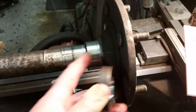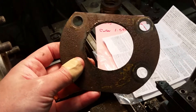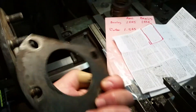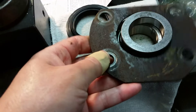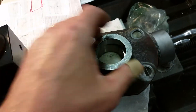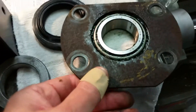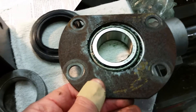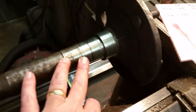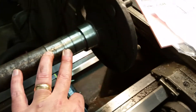The retainer plate is not going to hold much - I've lost an axle shaft more than once and you think that plate is the whole hail Mary, but it's not. I have made these plates before with a smaller hole so it would catch the inner race too, because if you start losing your bearings the inner race might save you if it's captured - at least that's my theory. Not too happy about this thousandth of press.